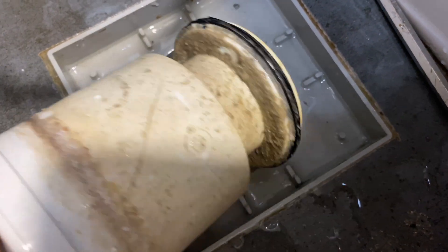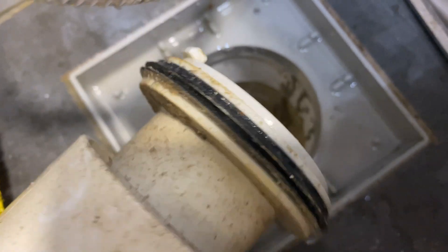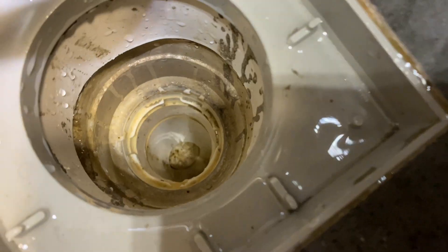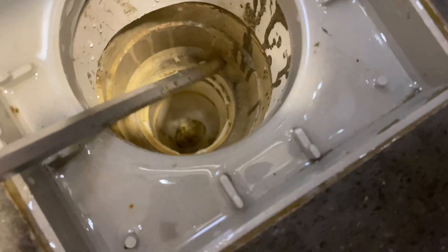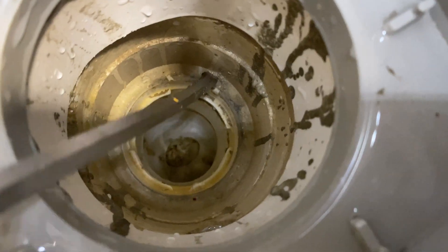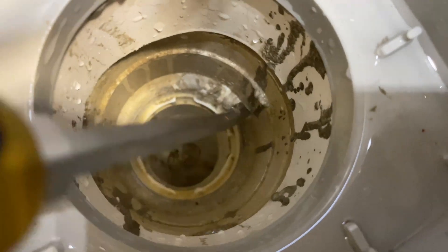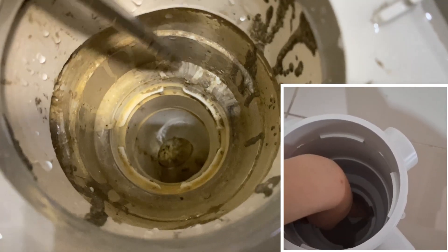You can see there are sand particles, maybe caused by construction, or perhaps there's some cement stain on the side wall of this pipe sleeve. This pipe sleeve is relatively larger so that it can accommodate this trap or bottle trap. What I need to do now is use a long screwdriver to push off all the cement stain.